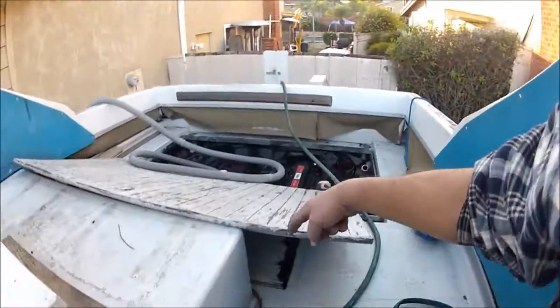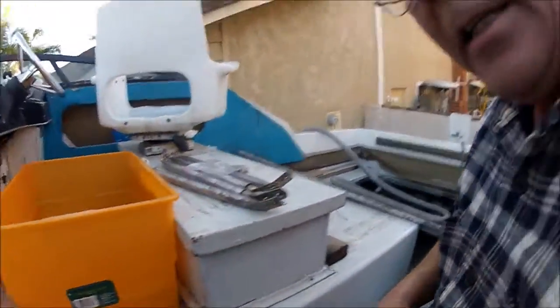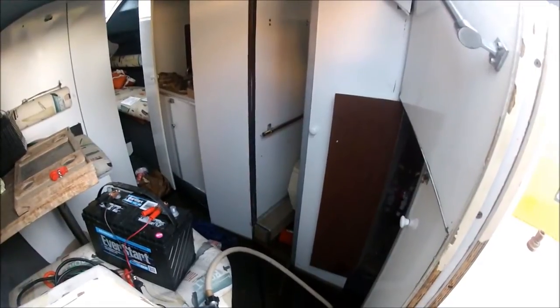So that was the problem — I've got lots of water. Once I get it all drained out, I'm going to pull the fuel tank out, which is located right about here. And I'm going to see why the main cabin and the engine compartment aren't tied together and why there's a separate bilge pump there. I know there's a bilge pump right down about where that hose is, but it's so deep — probably about 10 inches deep right there — and I can't get to the wiring.